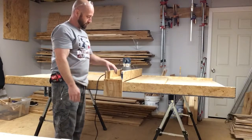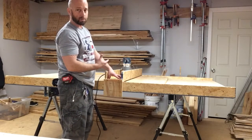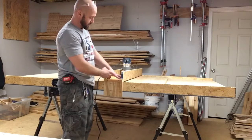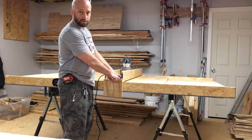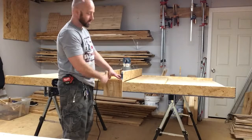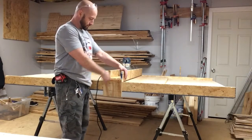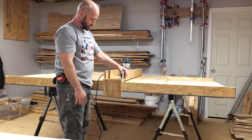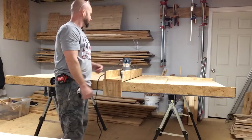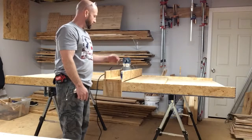For the sled I used a six-inch bottom. The width of my base on my Bosch router is six inches, so I made it six and an eighth inches wide to give it a little play — that way it slides nice and smooth. I've got four-inch rails on the sides to keep it in, and six-inch pieces down here just for the guides.